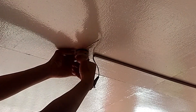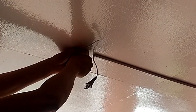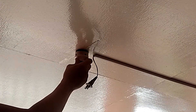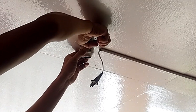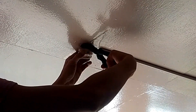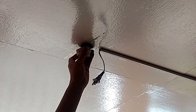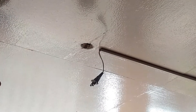Let's try this again — and it still won't budge. It's likely because, like the light switch, it has been painted over and the dried-up paint has bonded the cover to the socket body. It's unlikely we'll ever get access to the screws, so it's time to use some brute force with a pair of wire cutters and just disconnect everything. Good thing there's a gap where I can slide in the tool and make a cut. I have to twist while pulling down to create a gap, and at last a good opening where I can make a clean cut.